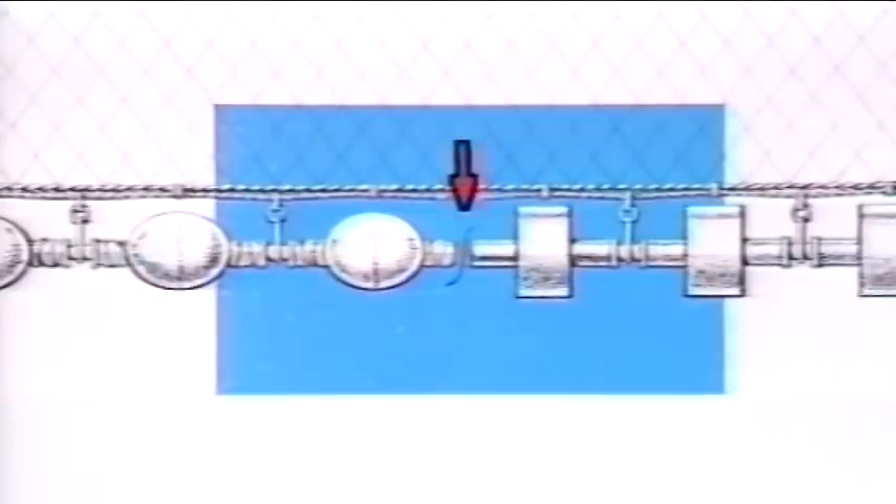This causes, on larger gears, a substantial gap between the fishing line and ground gear, allowing fish to escape. To prevent this, the fishing line can be slackened out, which drops the fishing line the aft side of the bobbins, and therefore closes the gap. If the fishing line is pulling forward of the ground gear, other problems may occur, as the bobbins or wheels pick up the belly netting as they turn.